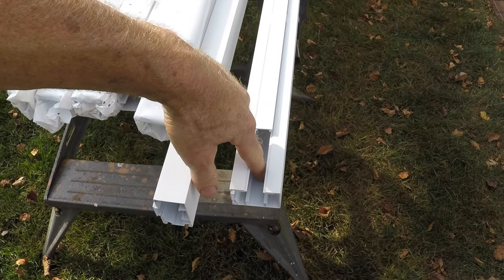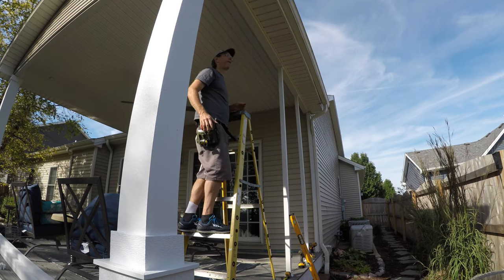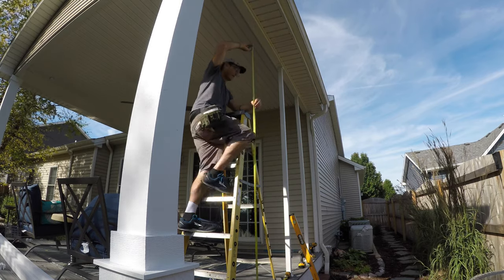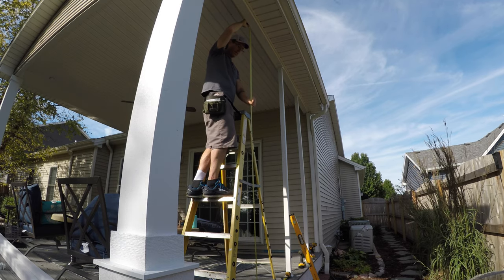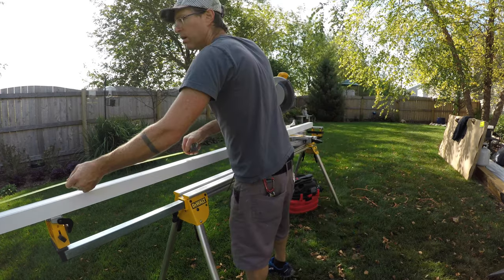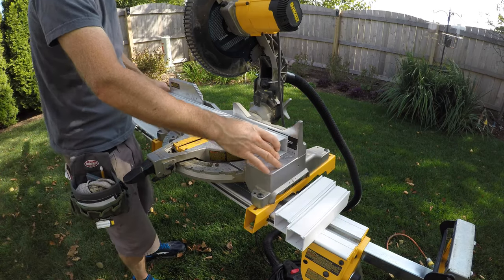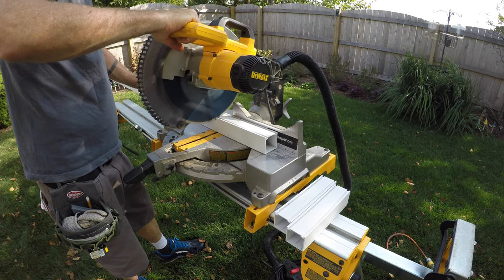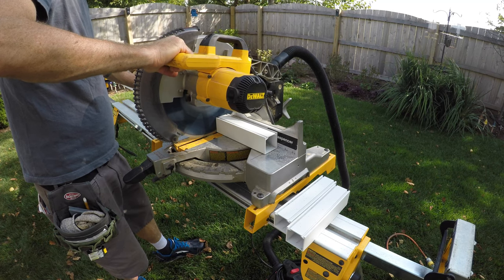The beginning of the build was pretty straightforward. It's all about sighting in your vertical members and measuring really precisely — not quarter-inch measurements, we're talking down to the 16th and 32nd. You can't pound aluminum into place like you would with wood; it needs to be cut exactly to fit. If it ends up short, you see the gaps.